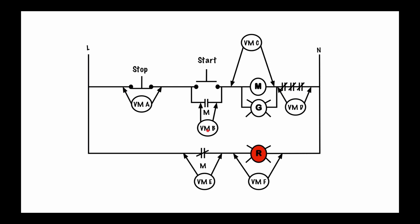Moving over to voltmeter B. I've got potential right up to this line here and then we have this open here. This is where I see many people make a mistake, because they would assume that on this side there's some sort of reference as well. But if you look here, this goes to the load and this goes to the light, and these are not engaged at this time. So what's going to happen is I'm going to read zero volts because I have zero reference point on this side. Whilst I have a voltage reference there, this will have no reference to that point.